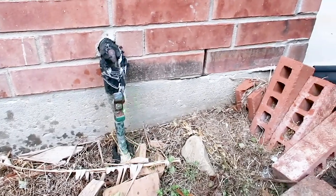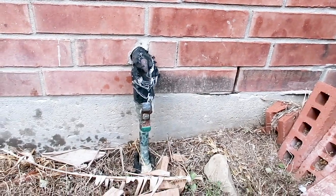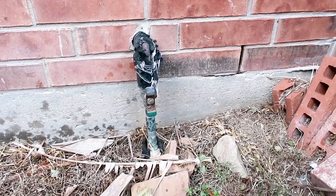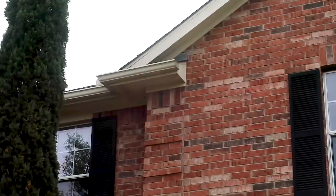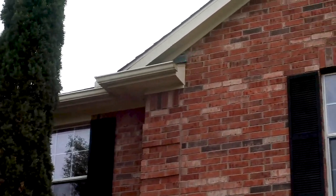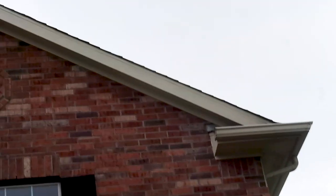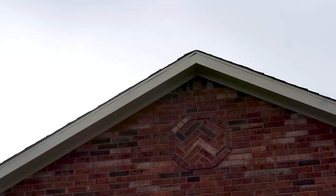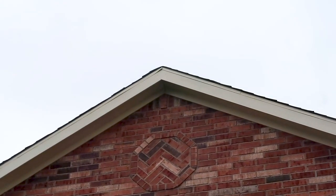Same thing with your water supply line — you can see this is copper, and these do break during frost. You want to insulate them to better protect from freeze. It is Houston, so it's not very likely, but when it does happen, the plumbers get rich down here. On a wide pass, you can see some flashing pulled loose here — a minor defect but still something to call out. At the top, the drip edge flashing is also pulled loose, and it just needs to be bent back forward to keep water from rolling back into the soffit area.